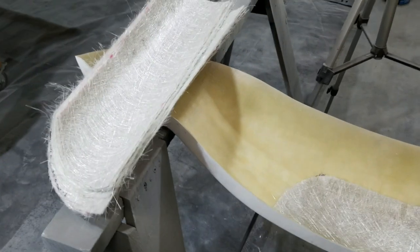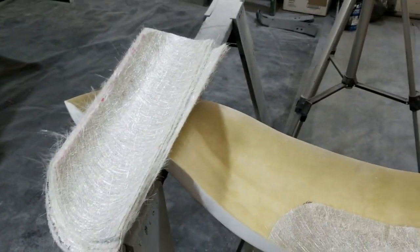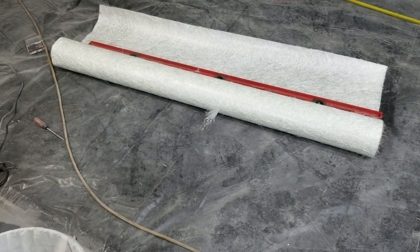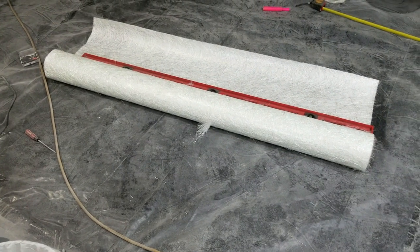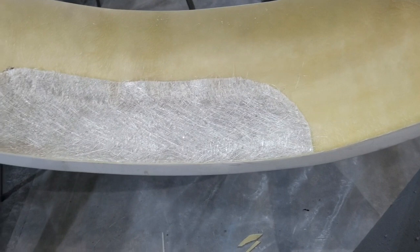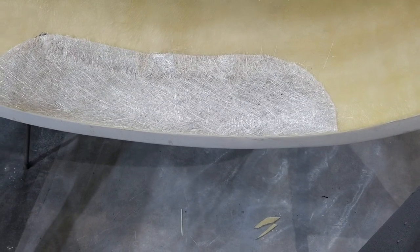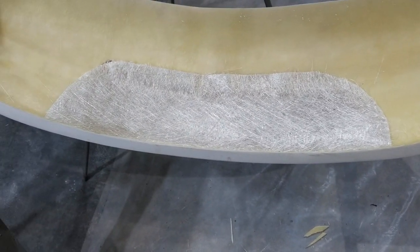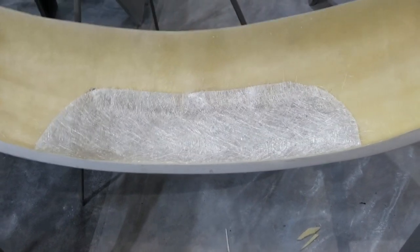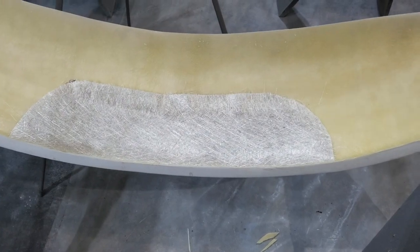I need to see if I have any. So this is what I'm doing now — I've cut out an inch or so of fiberglass mat out of my roll. That's marine grade, and it's thick and very, very easy to work with — pretty handy stuff. And what I'm going to do is layer upon layer upon layer. I'm going to build up a sandwich, and once it's done it'll cure in 20 minutes, but I'll trim out the excess I don't need.